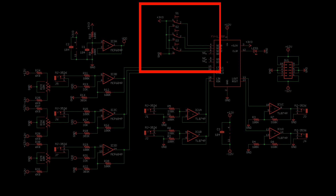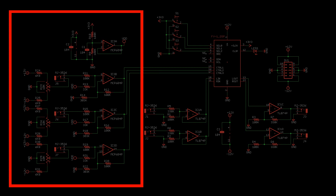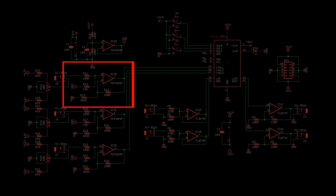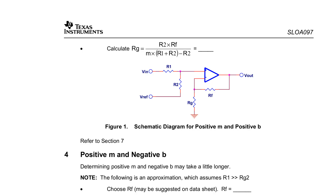The DSP functions are controlled by three toggle switches. Patchable potentiometer inputs are routed through switched jacks, then through a gain stage that shifts the minus 5 to plus 5 volt input range to a 0 to 3.3 volt range. More on the math behind this can be found in the SLOA097 application note by Texas Instruments.